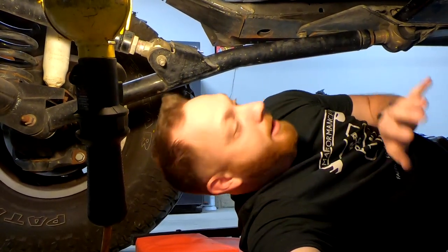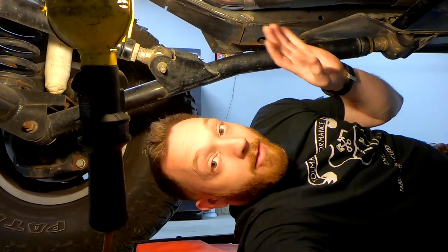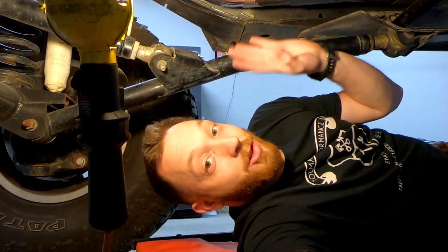So this is more or less your last chance to make sure everything fits. So just double check clearance around things like the floor pan and the cross member, because we're on a 3-inch exhaust from the Y pipe back. There's not a lot of room to make everything fit together. So like I said, now that we've got this one last connection, it's the last shot. So I just got everything where I want it. Now we're gonna tack weld this, take it out, and finish welding on the bench.